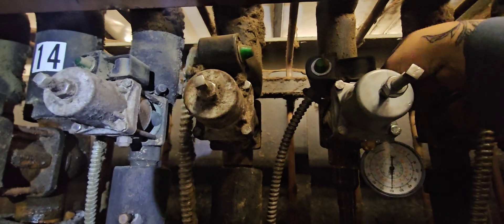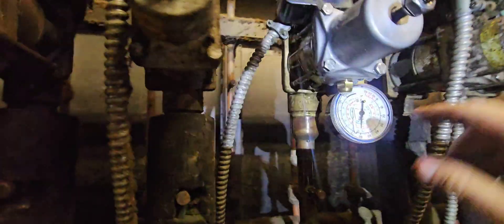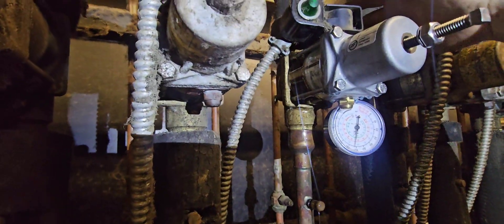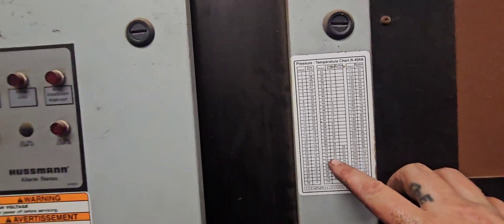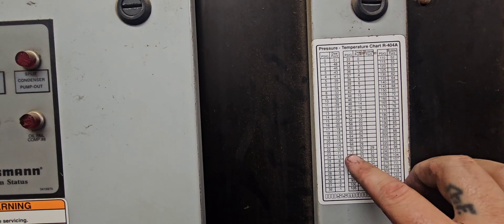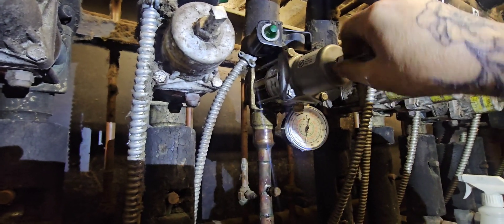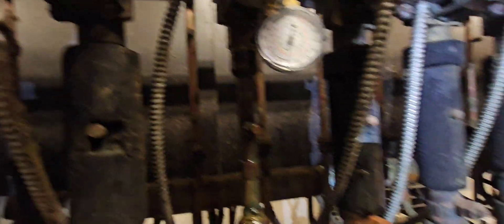This thing's been running for a minute. We're going to start adjusting the stem. Right now it's all the way out, so we're running at rack pressure — there should be no difference between rack pressure and the pressure on this valve. If you remember, the RS sheet showed a 32-degree evap. Looking at the PT chart, 32 degrees corresponds to 72 pounds, so we want to set that EPR to 72 PSI. All we do is take the stem in until we hit 72 pounds, and this thing should adjust a lot better because now it's properly sized.